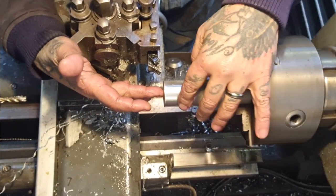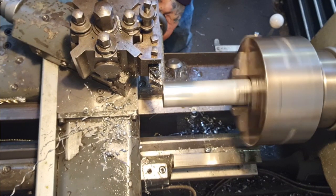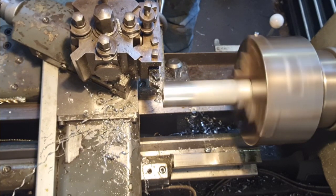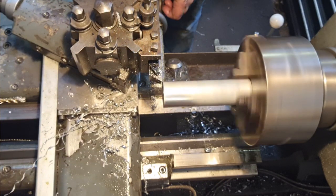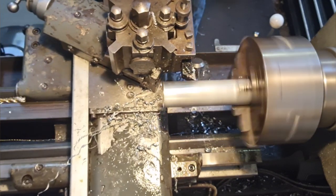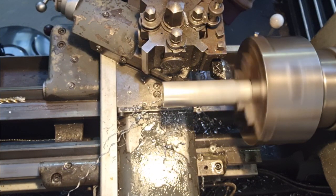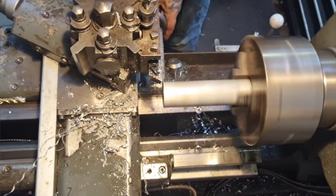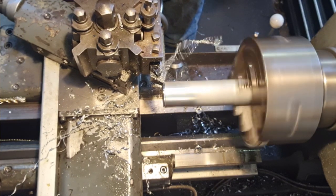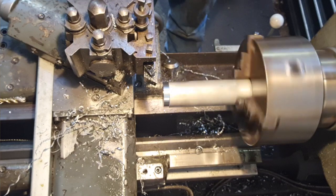The bit I'm not sure about is there's a lot hanging out. I think it went to trim up to four inches and a bit, and then cut the outside diameter down — step it like. But I reckon this will be aided. They're a hundred long, which is right. Let's get a cleanup cut, see what happens. It'll touch on, give it a bit. The machine's lovely with this tip, so I don't think we've really got any worries.